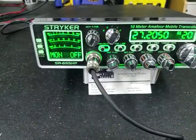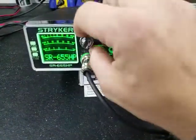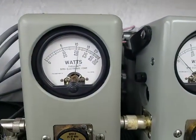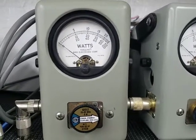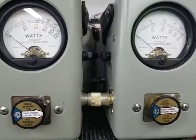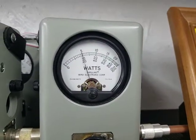Okay, now let's get right to it. Turn the RF power all the way down — five watt slug. We've set it to key up at two watts, just in case you decide to run it into a high drive amplifier. But I don't recommend running it at that with just the radio. RF power all the way up — 100 watt slug.